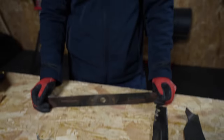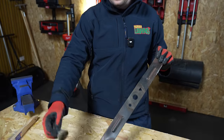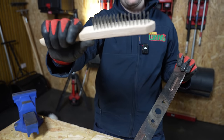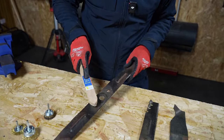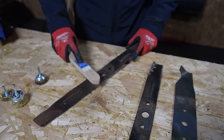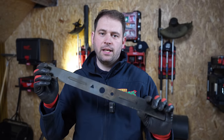I've got the blade off the mower — it's time to get it cleaned up, whether mechanically with one of these wire brushes or a hand brush. This is what I'm going to start with. To speed this up I'm going to get the drill out, get this into the vice, and use one of these wheels.